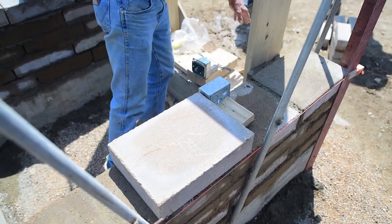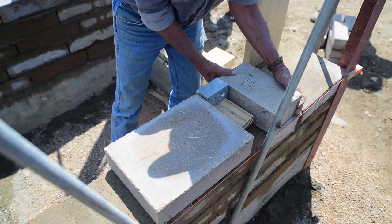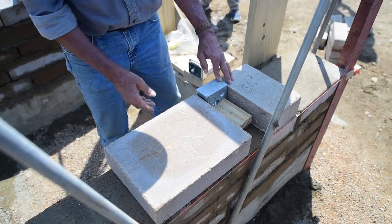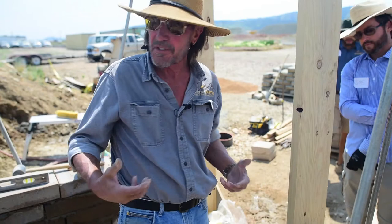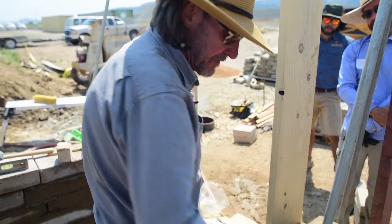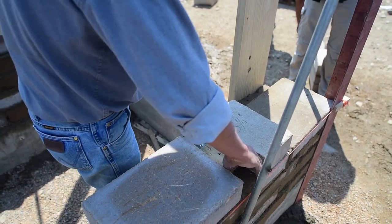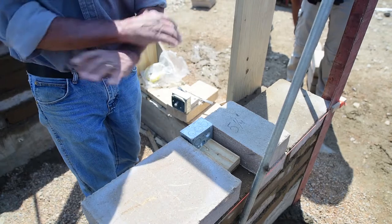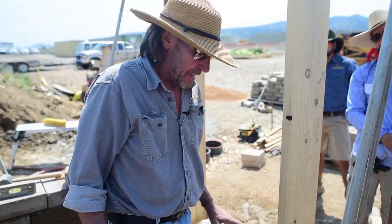Here it comes in, and remember these have mortar under them, so this is all flat here. This is adobe, and we have certain things that provide forgiveness. One of those is we'll put a little chunk of adobe in here, just enough to keep the mud from running out. It doesn't have to be perfect — just something that stops the mud. Then in this space, once we've got the wire running, we'll just throw broken chunks of adobe and mud in there and fill it up, just for the thermal mass. It's not a structural element.